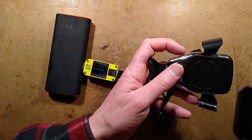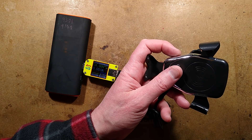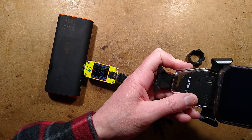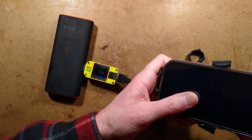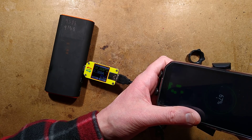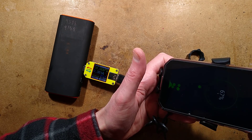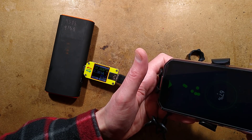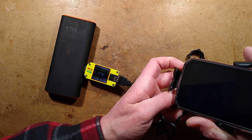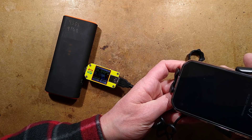It's booting up. Sitting the phone in — the current has gone up to a fairly miserable 380 milliamps because it's not perfectly lined up. It's all a matter of finding the sweet spot of where that coil is.